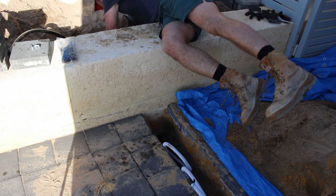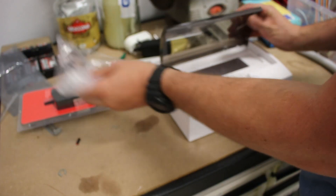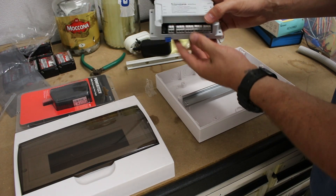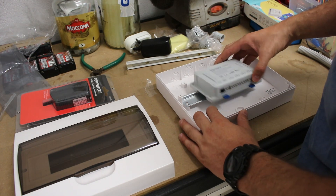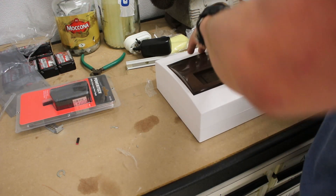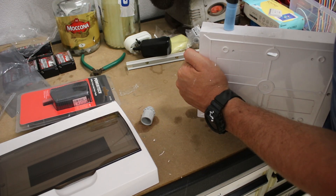I used 20mm flexible conduit to protect the control cabling from where I'd install the controller, and I'd already put a drawstring in there to help pull the cable through later. For the controller there are plenty of options, but I'm a bit of a hobbyist when it comes to home automation. I got a Wi-Fi 4-channel relay and flashed it with open source firmware called Tasmota — I'll leave links down below. The controller mounts on DIN rail inside a little housing. I'm not convinced it's 100% waterproof so I might silicon it up later, and I made a few holes in the box for 20mm conduit glands.